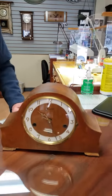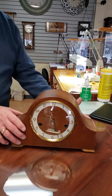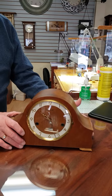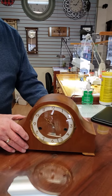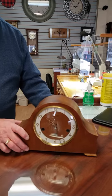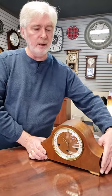That's enough usually to get the clock ticking. The ticking has to be very even and not what we call out of beat. If you listen to the clock carefully, it should be a nice even cadence — tick, tick, tick, tick, tick. If the clock isn't doing that, make sure your surface is level. If you can't find a level surface, you may have to shim one side or the other of the clock slightly to make it tick properly. You can experiment with that by listening to how it changes the sound when you lift it.